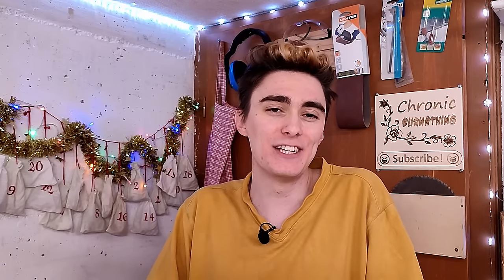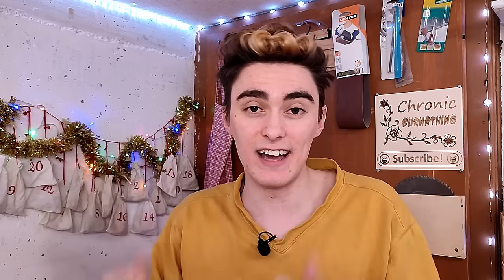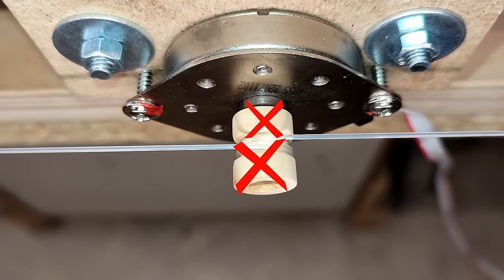Basically, after I found out that microstepping wouldn't fix the poor resolution of my steppers, I didn't give a shit anymore and finished it the way it was planned, just to see what would happen. Well, now I know, and to do it properly, I would definitely have to make a new X-axis gear reduction with a bigger diameter drive drum so as not to bend the fishing line as tightly. And it definitely cannot have flanges constricting its movement up and down the drum.